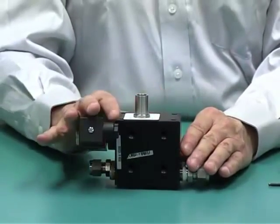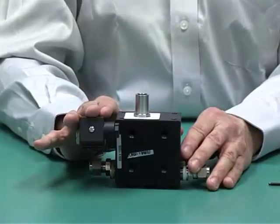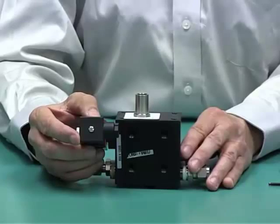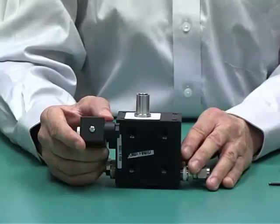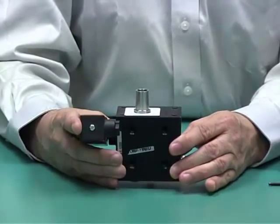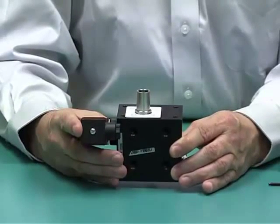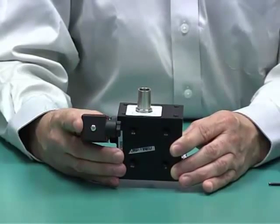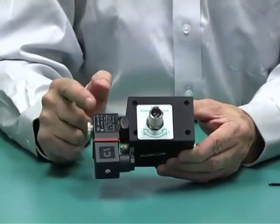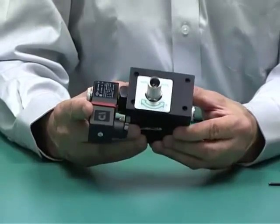So that is with this type of manifold. This is an ATEX — you can get an ATEX rated valve or an FM/CSA Class Division rated valve. The Class Division rated valve will have a conduit for explosion proof, and 24 inches of cable coming out for termination to the control unit. Keep in mind that when you order these valves you have to specify the voltage. They come in 24 volts DC, 120 volts AC, or 230 volts AC. The 5500 control unit operates on 95 to 250 volts AC, but you still have to specify what voltage you will be operating the valve at — if it's 120 volts use a 120 volt AC valve, and if it's 230 volts AC use a 230 volt AC valve.